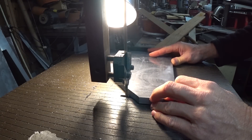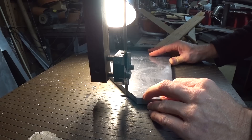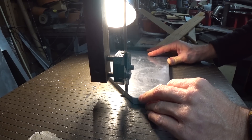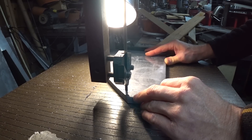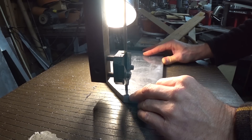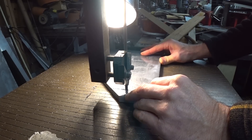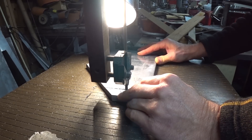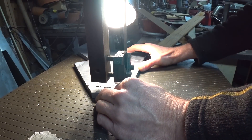Another job was cutting the two pieces of lead for the elevator counterweights. I'm starting out cutting them three and a half inches square, which gives me about two and a half pounds for each piece — five pounds total. I should have changed out the blade on the bandsaw because I was using the one with fine teeth, which gets clogged when cutting lead. It's better to use a much larger tooth blade, but it wasn't that many cuts anyway.